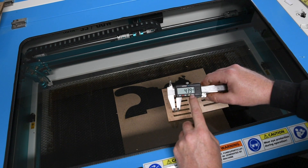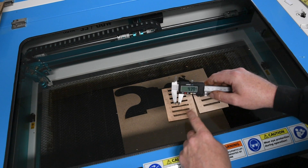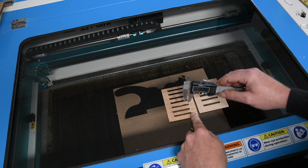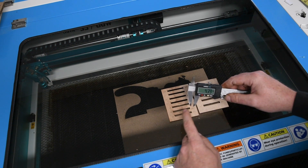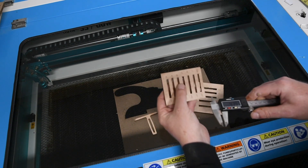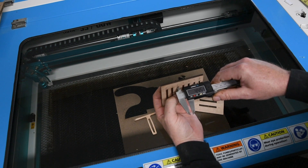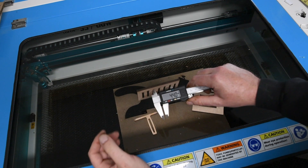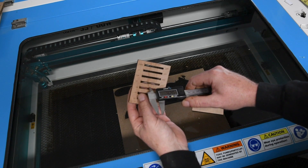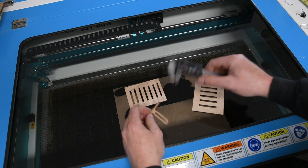If I knock 0.2 off for each side, that gives me four millimeters. So for each cut you're losing 0.2mm — at least I am on my laser, which is an 80 watt. If you've got a more powerful laser you have to work out your own kerf. You can see if it's cutting at four millimeters, when you actually measure the piece it's right around 4.4mm, because I've lost 0.2mm either side.